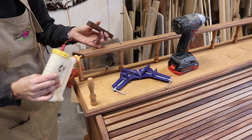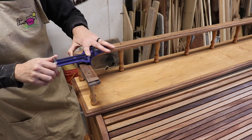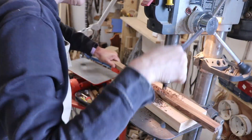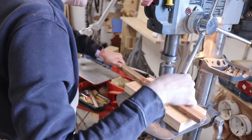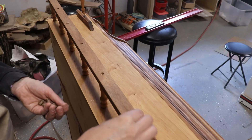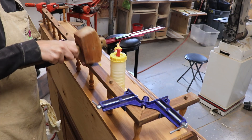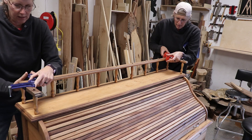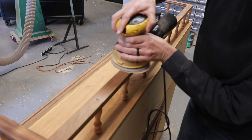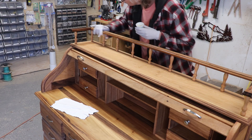Then I added the small side molding boards. I used a little glue in the corner, placed the screw, and used a corner clamp to hold it, and did the same thing on the other side. Then I took some monkey pod and used my little plug drill bit and drilled some plugs, then popped them out with a flat head screwdriver, dried them in, and then glued them in. Later I removed those corner clamps and chiseled off the protruding part of the plugs and sanded it. Then I added Rubio to this molding board — and this was the last thing that needed some finish applied.